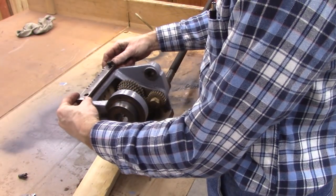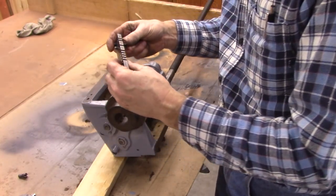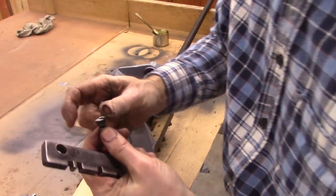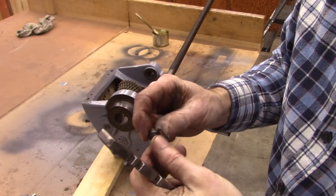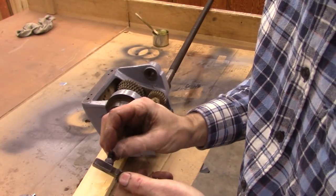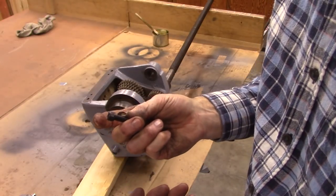Yeah, this plate has to go right there. That's what the shift lever for the gearbox meshes into. Had these screws in there. I've seen better days and the threads are all messed up on them. I ran a tap through these. I'm going to put some socket head in there, but they won't quite fit. I can either bore that or turn these down.